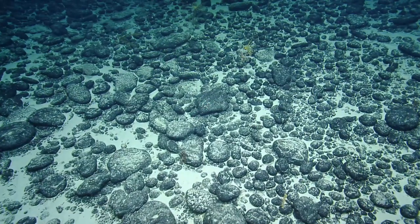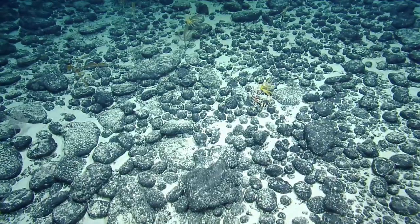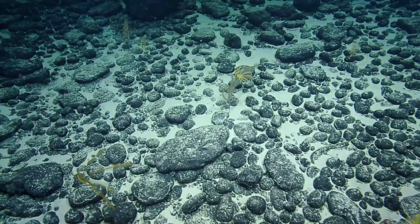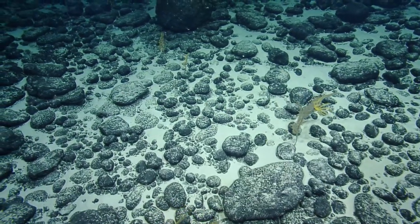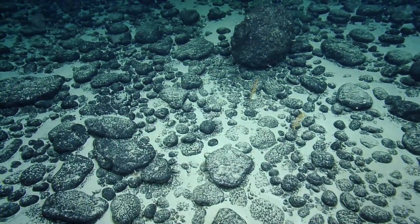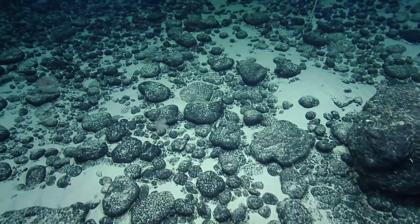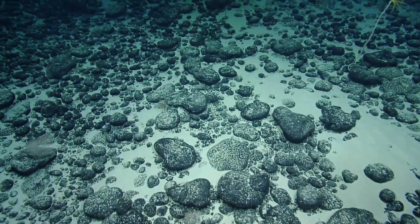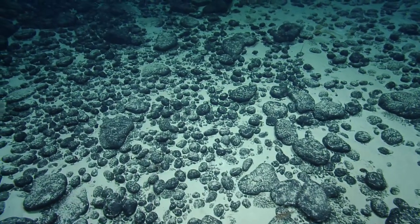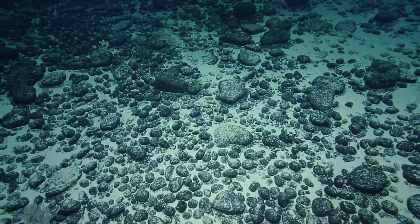Okay. Got it. The wire cam is this camera here, which control van can see, viewers can't, but it's the camera that watches the 6/8 cable, which is the cable that connects to Atalanta. Why is it called 6/8? Because it's 0.68 inches across in diameter. It's steel encased, and inside are steel wires, power and fiber optics to the vehicle. Copper conductors and fiber optic, and then a bunch of insulation. 10 gauge copper conductors and 6 fibers, I believe.